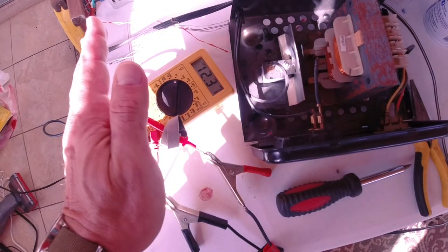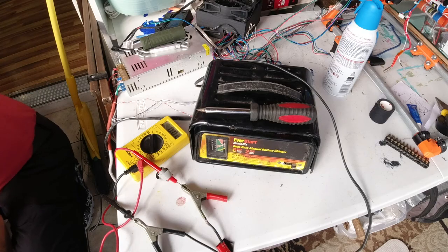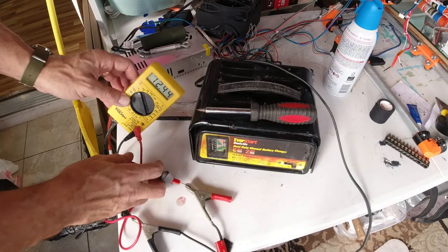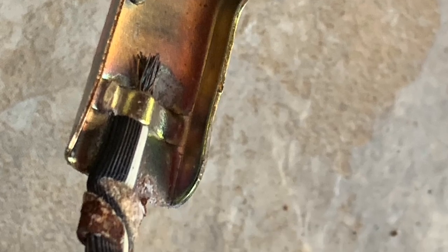Looks like we got it! Can you believe it was just that connection? That's all we have for today. A simple connection — deep troubleshooting process took me a while to get to it, but it was a simple connection failure. A combination of corrosion and the wire becoming a little loose where it came in. I just made it tighter again, pressed down on it with a screwdriver, and we're back in business. Glad to have it back and working — thanks for watching, we'll see you next time!